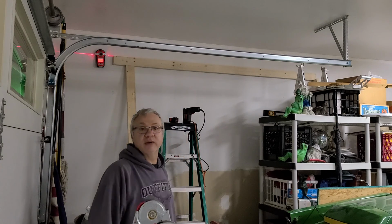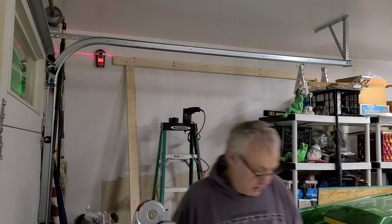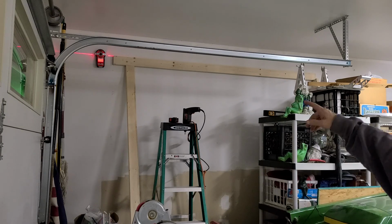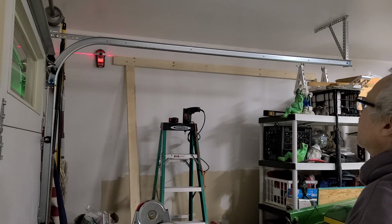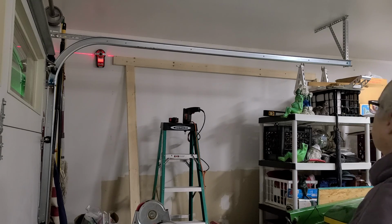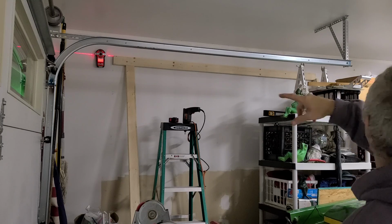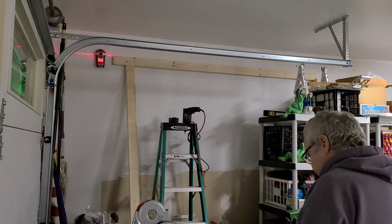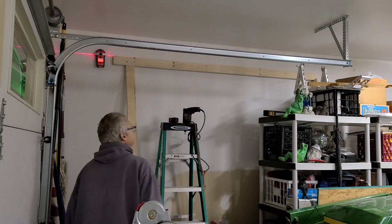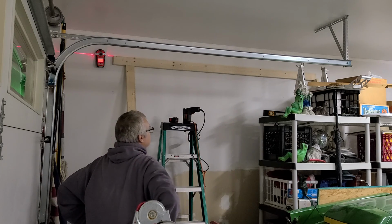What we're doing is putting up some heavy-duty shelving. Behind me, you can see I've gotten started a little bit. I've just got one board lined up there. I've got a fancy digital electronic laser level that throws a level line out there, and I measured up 8 feet, which is my height. The 2x4s that we're using are standard 8 foot studs, and I'm just running those across there. I'm going to do two 8 foot lengths there, but I'm just going to start with the one.